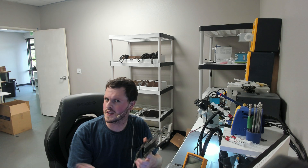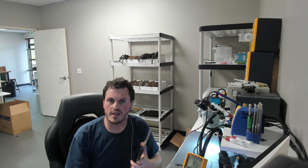Let's get this board out and have a look under the microscope for any visual signs of damage around the backlight circuit. Our backlight circuit generally has some main smoothing capacitors. I'll pop up a schematic for reference. These capacitors are usually the culprit whenever we see shorts to ground — it's usually one of them that fails and causes the issue.